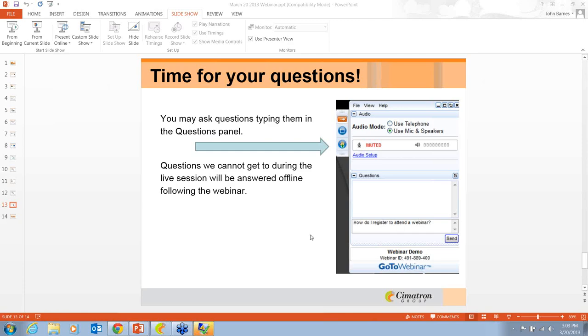Yeah, here's one. Are we able to define meshes bigger or smaller, define manually? Yeah, that slide bar that I had shown earlier had an accuracy setting of 1 to 5. The 1 or the 2 was for fast calculation, just to see a quick filling. That goes incredibly fast. If you go up to a 5, that's incredibly small. You're going to get many millions of elements. And so for very thin wall, small micro parts, you can use the highest settings, but there is a very good range of accuracy from big parts to small parts. It's all handled right there in that range.